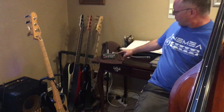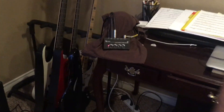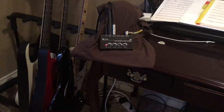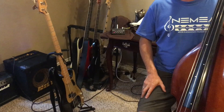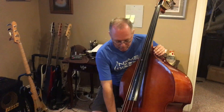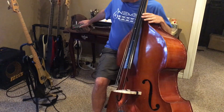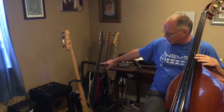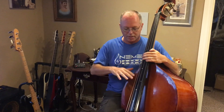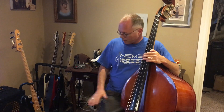Hello again YouTube world. This is part two of a three-part video review series of the FiFine Technology N5 Ultra Low Noise 4 Channel Line Mixer. For this video, I'm going to demonstrate how you can use this mixer in a gig situation where you have to go from double bass to bass guitar using only one amp. I've got a double bass here. I'm using a David Gage Realist pickup directly into the mixer and then over to the Mark Bass Combo Mark II amp. The output is quite low. In a performance setting, I would use a separate EQ for a little bit of a boost and do the EQ more specifically to how I want it on this instrument. But right now, it's just going directly into the mixer.